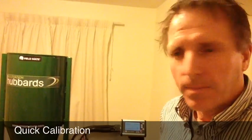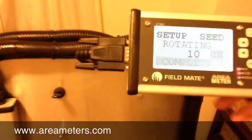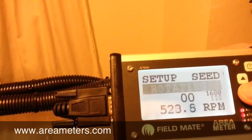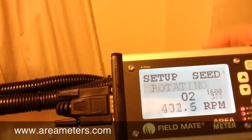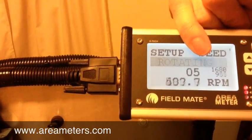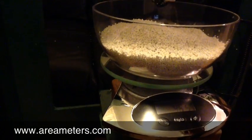So you've had the rundown on how the system is all sort of geared together. We'll go about calibrating it. This is our main screen here — we come all the way down to 'Set Seat', quick press power, 10 turns. When this number gets to 10, the system automatically stops. This is counting the rotations of the drive motor. You can see the material coming out of the coulter into our scale. Really critically, we get this right down to the gram resolution. We've got 467 grams.